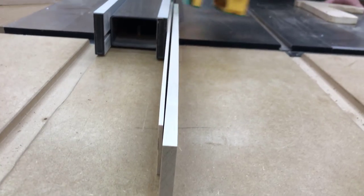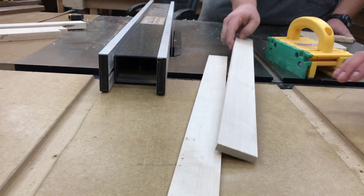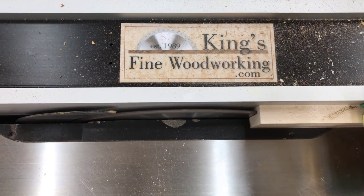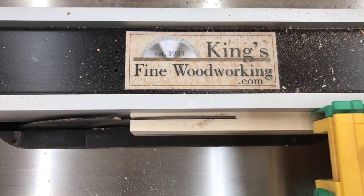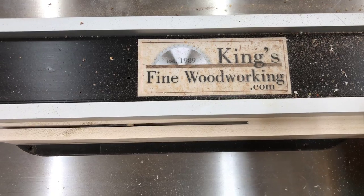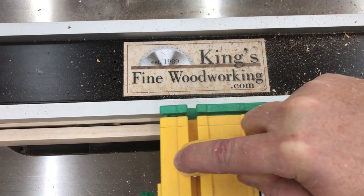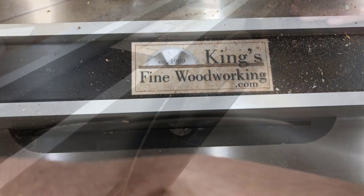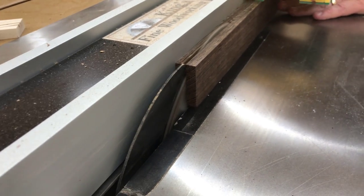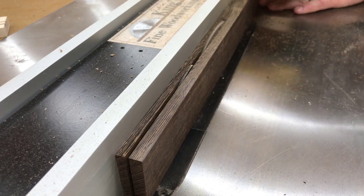Instead of having the cutting board all one color I decided to put some accent colors in it. This is maple here. If you decide to make a thin cut like this, a bandsaw is a good choice. If you want to use a table saw you can do that as long as you're comfortable with the cut. You'll need something like a micro jig in order to safely grip a thin piece of wood on the other side of the blade. And this board is wenge — I thought this would be a nice addition to the cutting board as well.